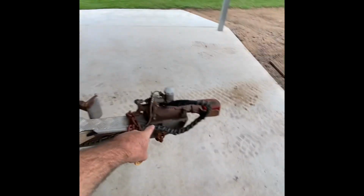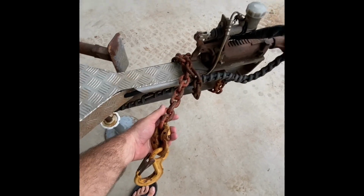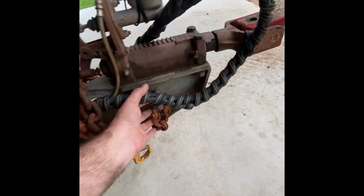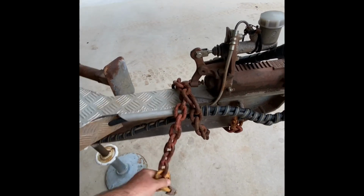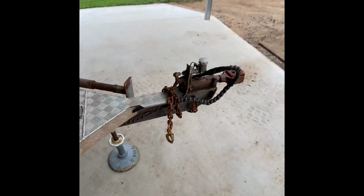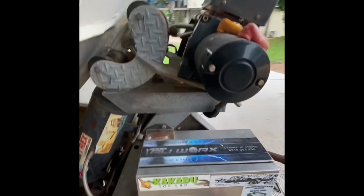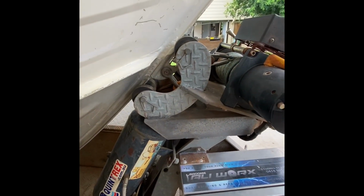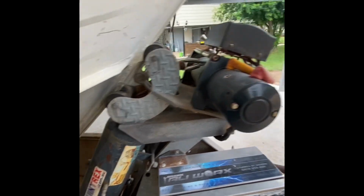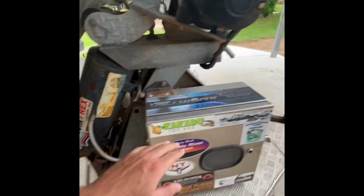This whole boat's no good without what connects it to your car. This is lifting chain. Use lifting chain, lifting links with the fully welded on rated eye. So this trailer is not snapping off. I think it is secure. So I've gone through, this is the thing. I run the winch for beach launches, uphill launches, getting out of the bog. So you can run this winch disconnected if you have to, run it to your car system.